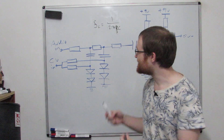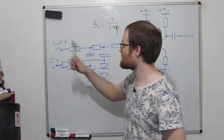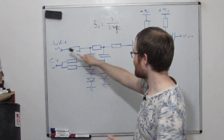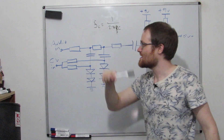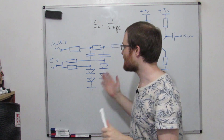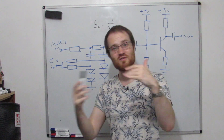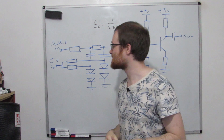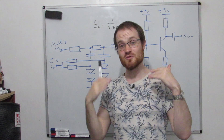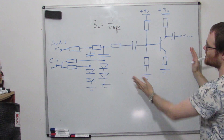This is why we need the input signal to be less than about a volt, because these diodes need 1.2 volts to turn on. So if we apply a 9-volt audio signal in here, that's just going to switch on these diodes and the filter will be stuck fully on all the time — we won't be able to affect how much filtering is going on with our control voltage. We're going to have to attenuate our audio signal so that it doesn't go above about a volt.